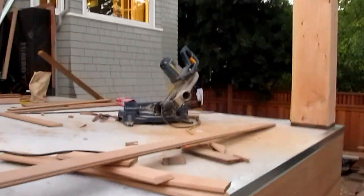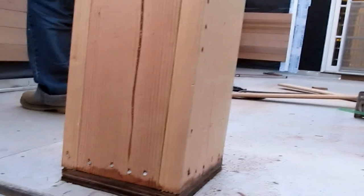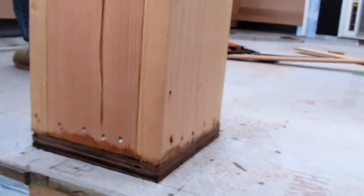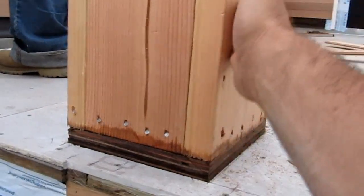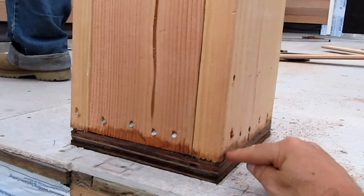This particular deck is going to have columns finished with shingles. These could be stucco columns. We are going to bring the waterproof membrane up the side walls, tile right up to them, and then bring the siding — whether it's stucco, shingles, or wood siding — and hold it off about two inches off the finished deck floor.